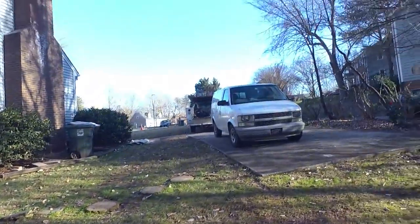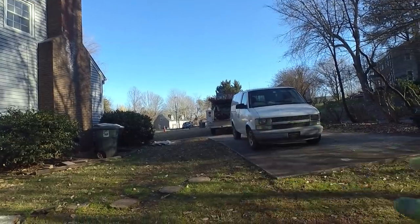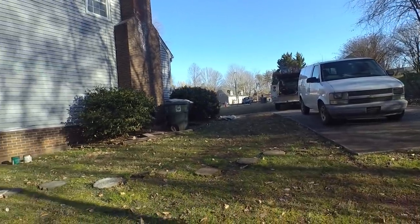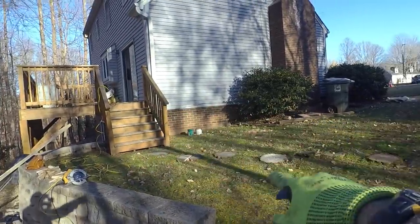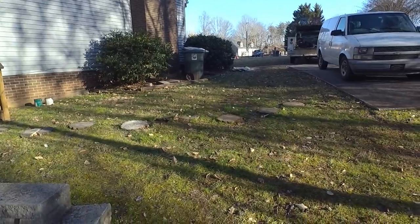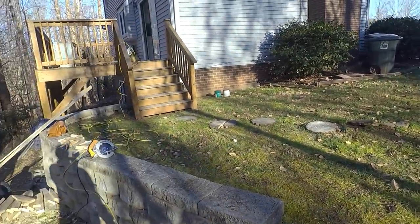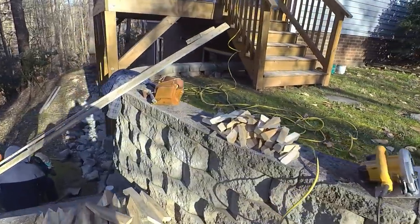And the water coming off the driveway as well, we're going to try to get that sloping away with our swale. So we'll come through here, cut, grab this gutter, bring it through here, get that gutter, so that gutter water will be out of here. We don't know where they come out, so they're probably just underground somewhere. Now take a look at this retaining wall.